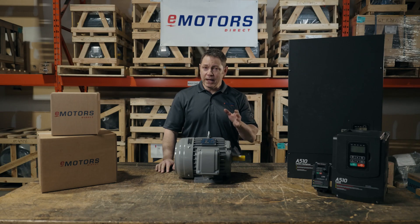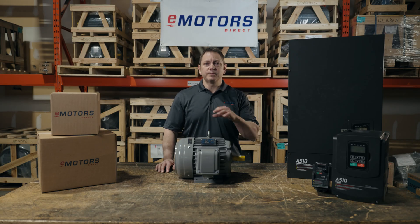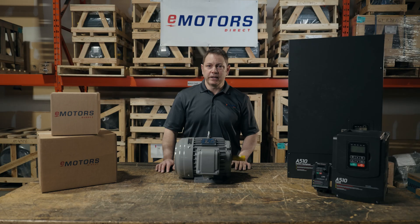However, we have seen applications where the VFD is used in conjunction with a power bypass from the line, to allow three-phase power for the motor while providing single-phase line power for the rest of the instrumentation.